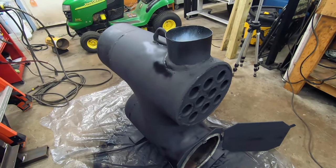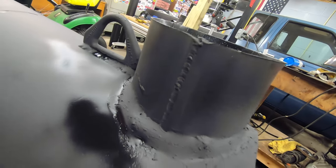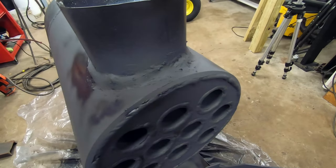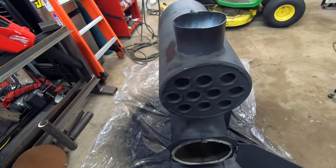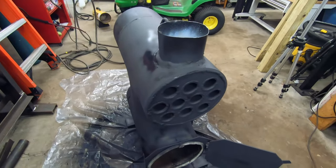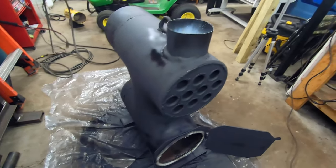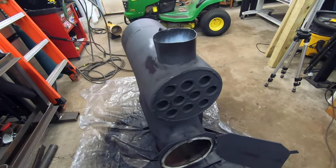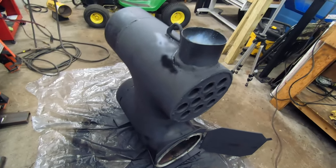Now I just took and coped a piece of single wall 6-inch chimney. I TIG welded that seal shut just to make sure I never would have any problems with it. Then I put this fire block paste in there. I TIG welded it down, but TIG welding 20 gauge sheet metal to 1/2-inch thick wall pipe tee, it's not ideal. Wasn't the best weld in the world. So I went ahead and put that fire block on there to hopefully get it relatively airtight.